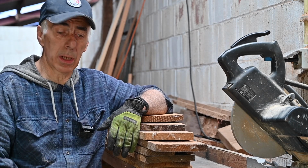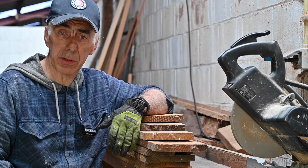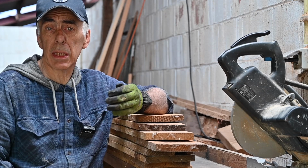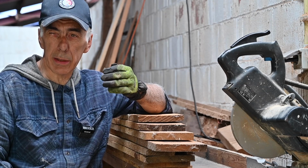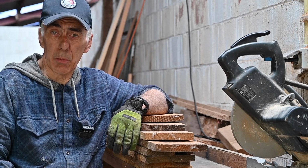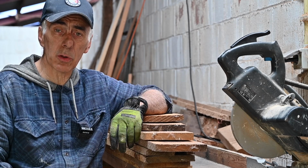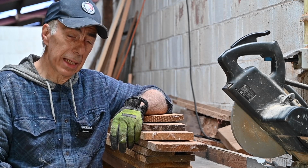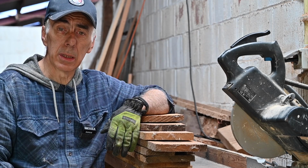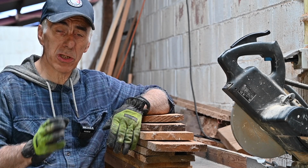And we still have to apply a tongue and groove on the plank, so that's going to reduce it by another centimeter. Therefore, I'm going for 8 planks, which actually gives me about 120 centimeters width for the door, which is more than enough. Now, there are going to be 2 planks that I will not completely finish on the sides, and that is the extreme left and the extreme right plank, and those will be cut equally to the same width, so we have a perfect match on the door.